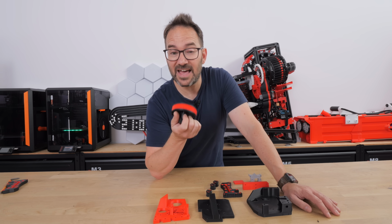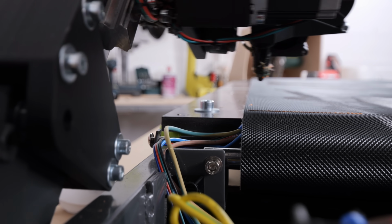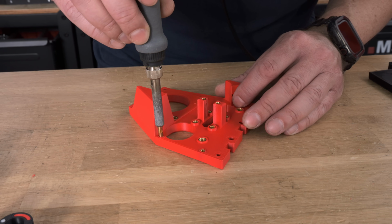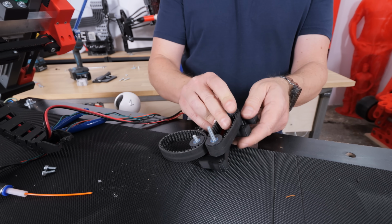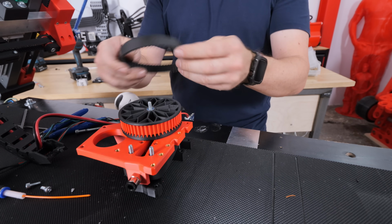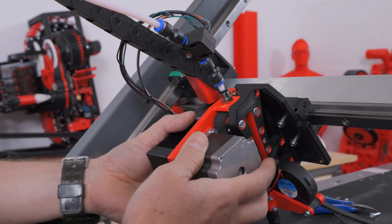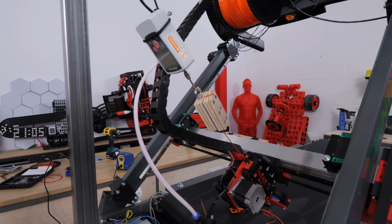So I polished the extruder design and reprinted every single part in ASA, even the multicolor pulleys, and modified every single part to make small improvements like maximizing the amount of belt width that can be used, but more importantly to use heatset inserts so it's easy to get it back together over and over and over and over. These 2 belts hug the filament like a raccoon on Red Bull. If you add to that a 3-to-1 belt reduction and a huge NEMA 23 motor, you end up with quite a powerful extruder. But let's use a force gauge to see the actual force.